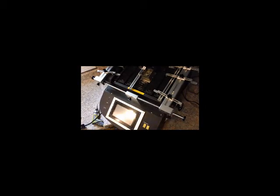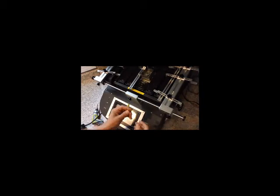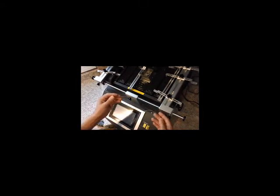What you should have with the unit is a stainless steel thermocouple. It's a stainless steel encased wire with the thermocouple in the tip. This is going to be used for reading our board temperature, and since this is rigid, we're going to put this one on first. This goes on the right hand connection, and then we coil up a little bit of it to take out some of the slack, and we run it under our front bar.